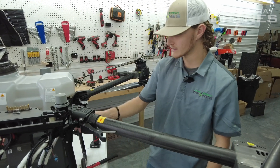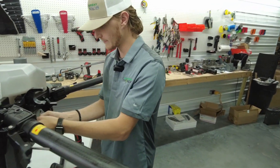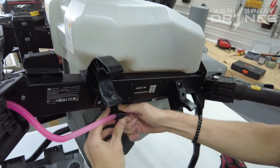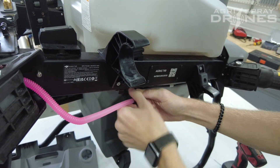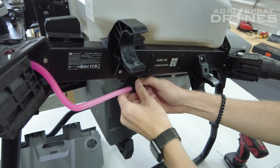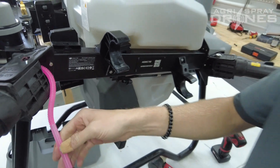After you do that, don't forget to undo your liquid line here — it's just a plastic wing nut, so just unscrew it. Make sure that your tank is empty because the product you were previously spraying will go everywhere once you unhook it.